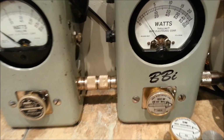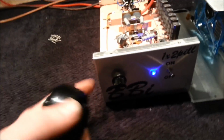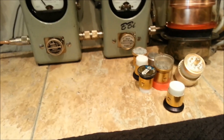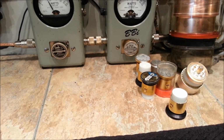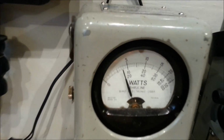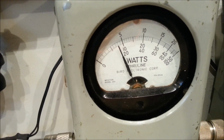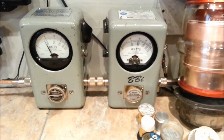Shut the amp off. Hello, audio. So seeing roughly 30 watts worth of drive out of the 66 today. Crank the variable all the way to max. We're now dead keying about 150 watts-ish. Look over here, we're doing 150 watts RMS. Remember, we're on a 1,000 watt sliding scale, so the 200 is 200. And that's 150.